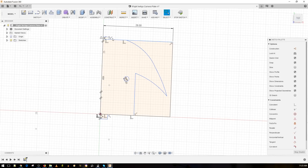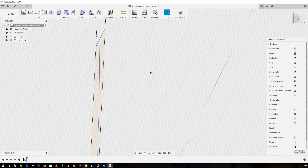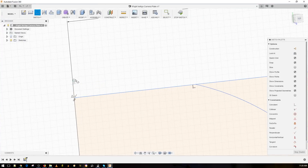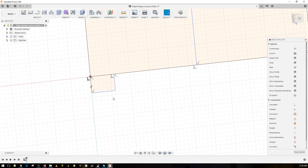Next we need to figure out how high these tabs are — they should be two millimeters. But we also need to figure out the length. The width is two millimeters so we don't need to worry about that; the carbon fiber is already two millimeters wide and it'll just slide right into the hole. We just want to make sure we get the length correct. The top tab length is around four millimeters, so let's set that up. Here's the first tab at four millimeters, and we'll drop this down.